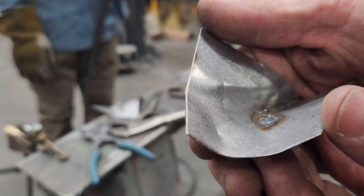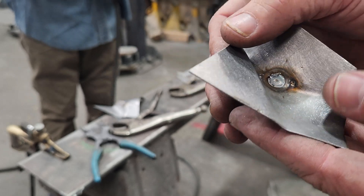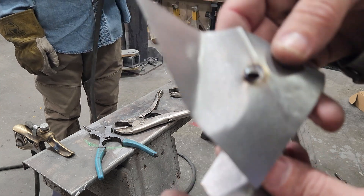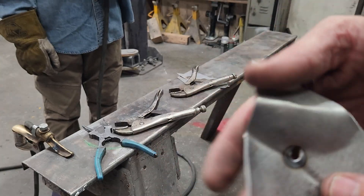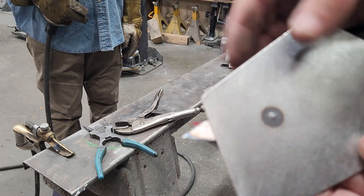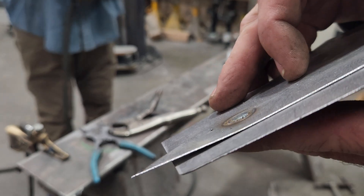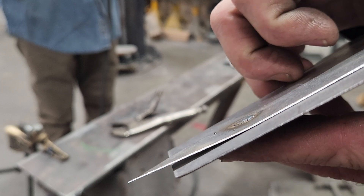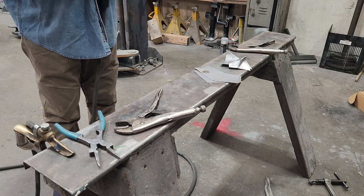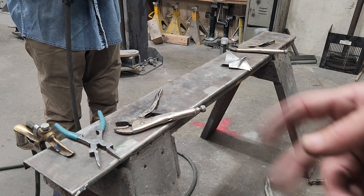He's running CO2 035 hard wire, and that is the thickness of a 2001 Pontiac Grand Prix car hood — it was cut up. The exact gauge isn't sure, but both pieces were identical. You did a very good job, buddy. Want to keep practicing? I think you put it down better than your dad. I got some pretty good penetration on the back side, but I shouldn't have hit it the second time — raised it up a little higher than I wanted to, so I'd probably have to hit it with a grinder a bit more. Been a while since I've done that. You want to do some more on this thin stuff? Sure — want to see if you can fill a bigger hole? Yeah. All right, we'll stop this right here. I hope you enjoy. Peace.